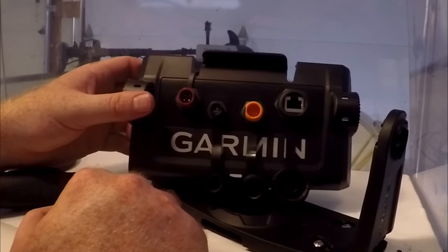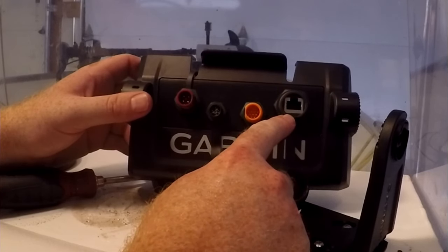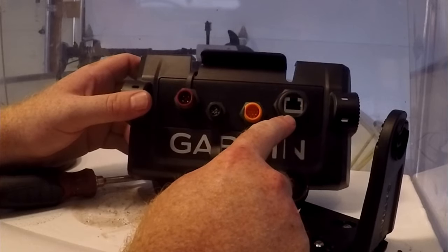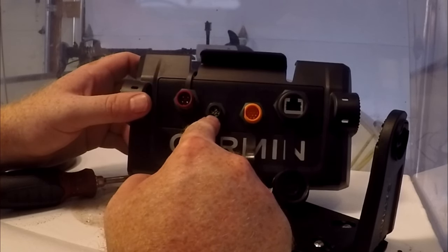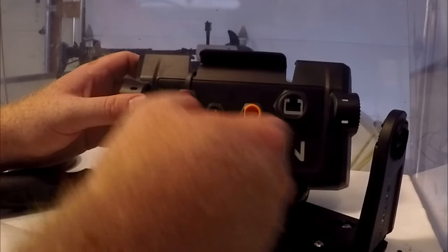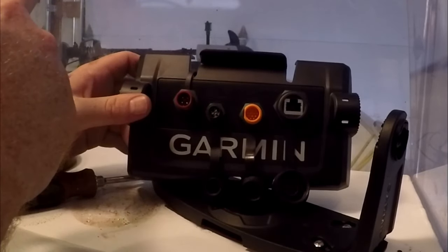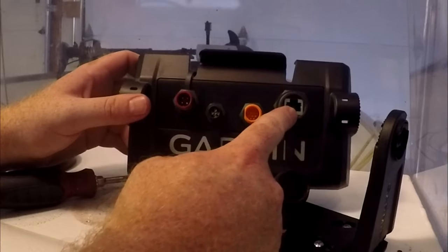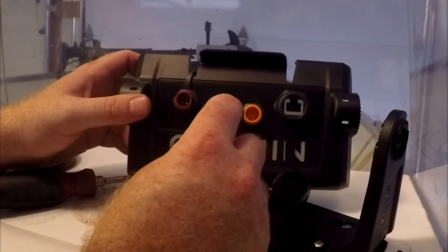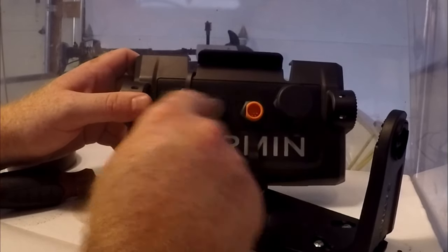Alright guys, I'm going to do a quick plug overview. You've got your PanOptix — I will not be using that, it's very expensive, I hope someday I could own it. I've got the sonar plug from the transducer that I installed in the last video. NMEA 2000 is a functionality that allows the front and back units to work together — I won't be doing that maybe someday. And then your power. You can go ahead and put the caps on the ports you're not using, and get ready for the sonar and power installs.